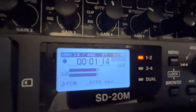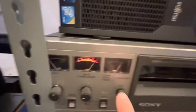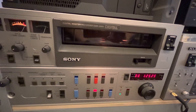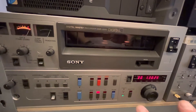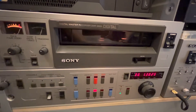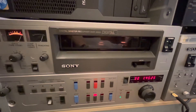That's kind of the quality control — I don't even need to listen to it as long as I've got healthy RF. I've wound the tape through to make sure there are no more sticking issues. The trick is, once the tape is dried properly it needs to get run fairly quickly, because if you don't, it's going to get sticky again within a few days. So even though it's a tape from the early 90s, it's quite sticky already.